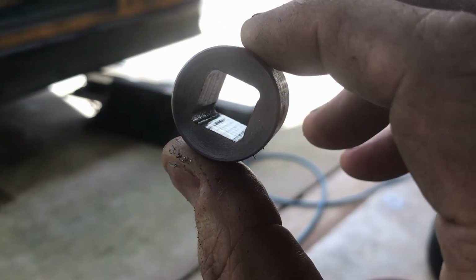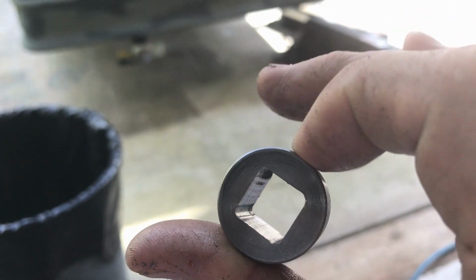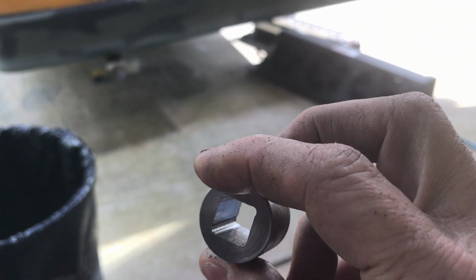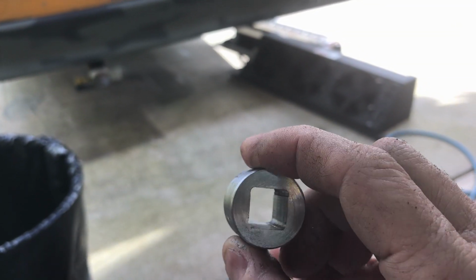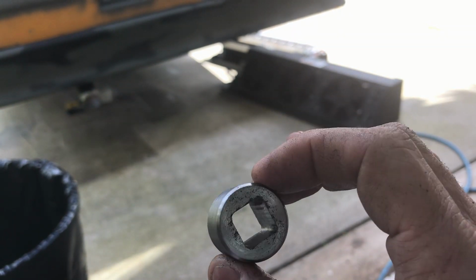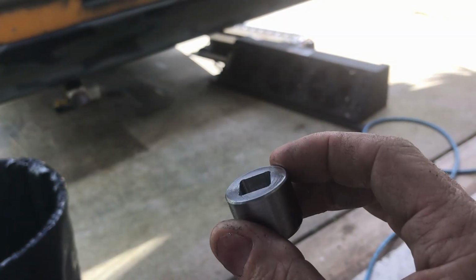Sort of looking here with the light. Yeah. Corners came out a little bit bigger than the rest of it. Just a little lesson learned. Next time I'm going to offset a little bit for the corners. When you're drilling straight down, I guess all the kerf, the bit is wallering around a little bit and makes the hole a little bigger. I knew it was going to come out a little bit larger. When you drill straight down that way, it's always a little bit bigger. But hey, this is great. So now we'll do some brazing.